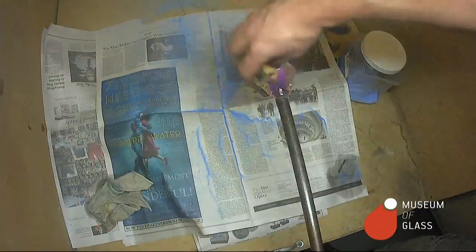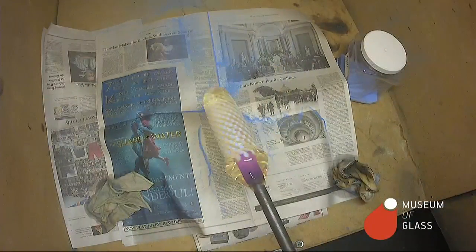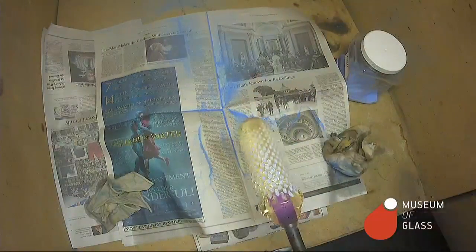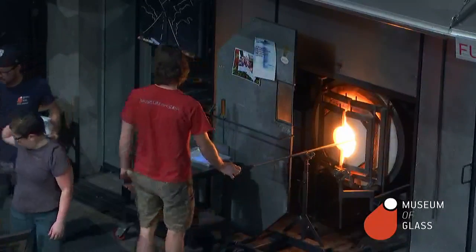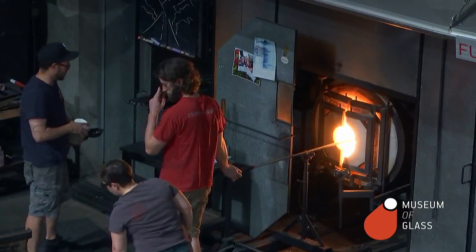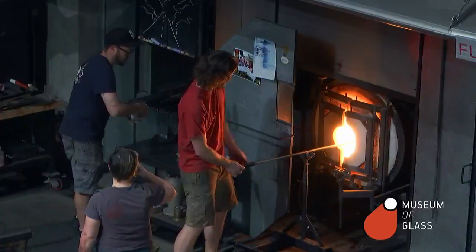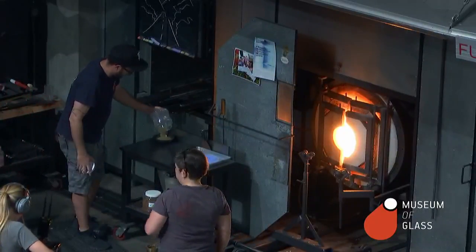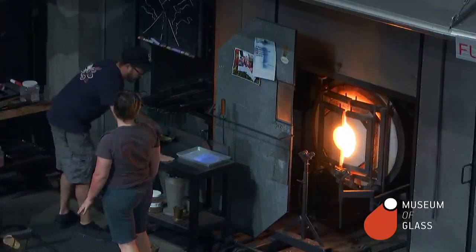One thing we always get asked is about these rods that we use here. They're made out of stainless steel, which is a very poor conductor of heat, which is the reason why our hands are not getting burnt. However, if you take a close inspection of each rod, you can see where the rod takes its damage, where it takes a toll. That shiny stainless steel becomes dull towards the tip of the rod. So where the glass meets the rod, notice in that area that rod is completely black, and that is that heat taking a toll. We're typically not placing our hand in that darkened area, rather the shiny stainless steel part.